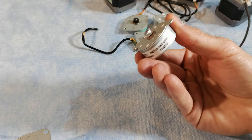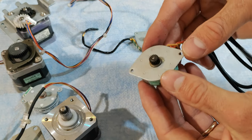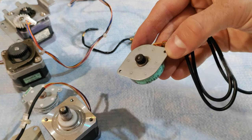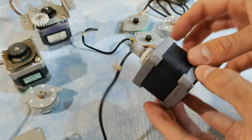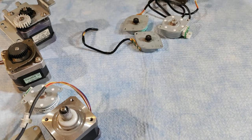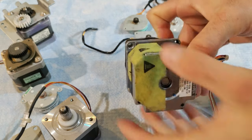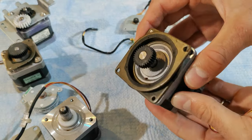We found so many stepper motors in each printer. Small office or home printers usually have smaller stepper motors, often used for small Arduino projects — they can be very accurate but their torque is limited. If you're after bigger stepper motors, look for bigger printers or copy machines like the ones in large office spaces. We found all sorts of big stepper motors including NEMA 17 and 23, which are often used for DIY 3D printers or CNC machines.